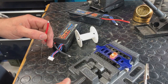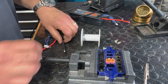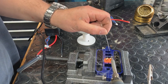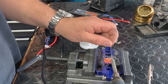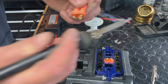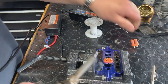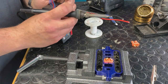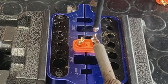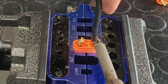Then we bring over our little jig here. It doesn't matter what you do first — negative or positive. Clean the tip off a bit, and we're going to put a little bit of solder on it, touch the insides here, and just drive some solder in. It heats up nice and fast. This is the negative side here. A lot of these plugs are labeled — it'll say positive there and negative there. We'll tuck one of the wires back on the battery and do our negative first. Heat that up nice and hot, press the wire in, and make sure that everything is nice and liquidy, nice and smooth.